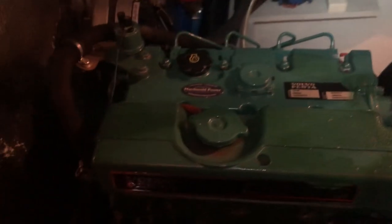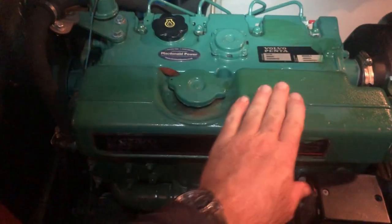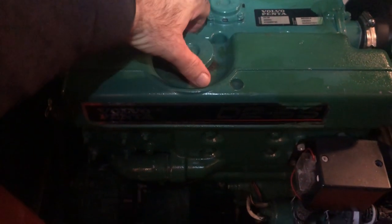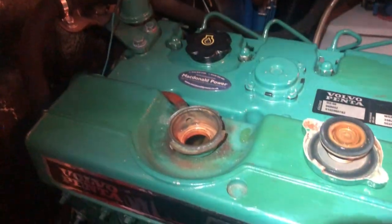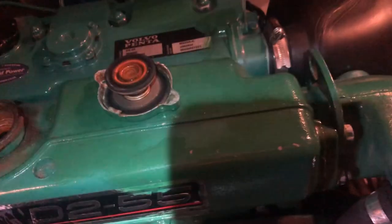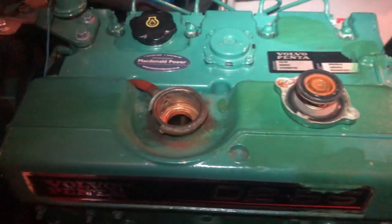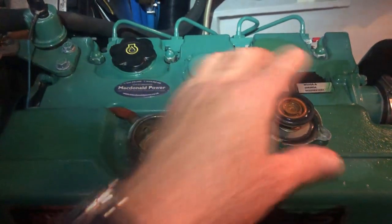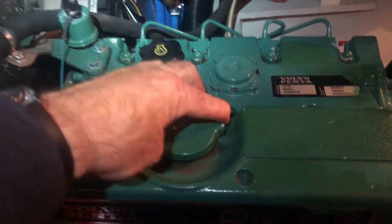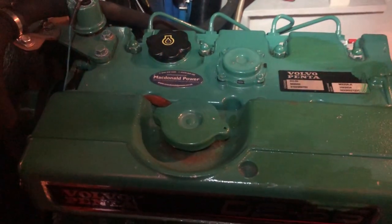You can follow the line of the water coming in and see where it goes to the heat exchanger, up through here to the strainer. The other part of the water check is fresh water. This boat doesn't have an expansion tank — it has a header tank on top of the engine. Take the cap off carefully, push it down and turn it 20–30 degrees, and it pops up. Check the water level; it should be about an inch down from the top of the neck. You can stick your finger in if you can't see it. This one is full, and you can see engine coolant with antifreeze — sometimes blue, sometimes red. Don't mix them: if it's got blue in it, don't put red in, and vice versa.